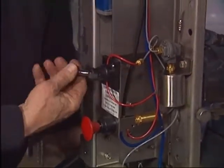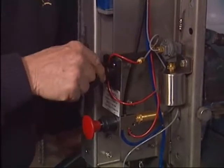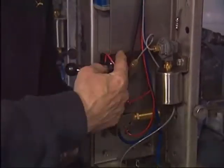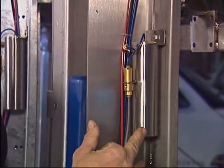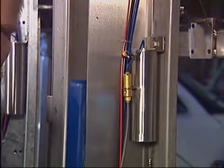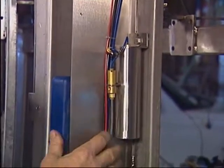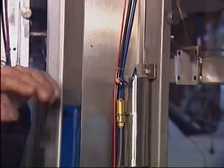There's an amplifier valve — I'll tell you later how that works. The manual-automatic valve: to the left it's always manual, to the right it's always automatic. It's basically another hose-squeeze valve — the air in the red hose either goes straight through or we squeeze it shut, making it manual. The startup timer is a two-minute timing circuit that deactivates the automatic portion of the machine for the first two minutes the machine is on the cow. In other words, if the cow is a slow let-down — three-times-a-day milking, late lactation — the two-minute startup timer makes sure the machine doesn't come off until it's been on the cow for at least two minutes.